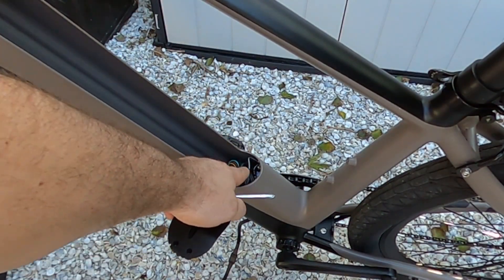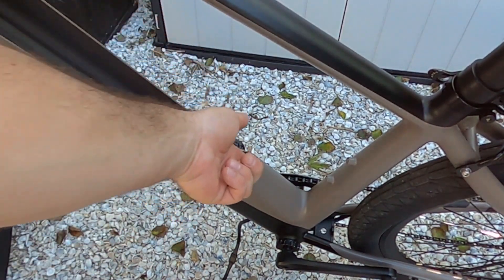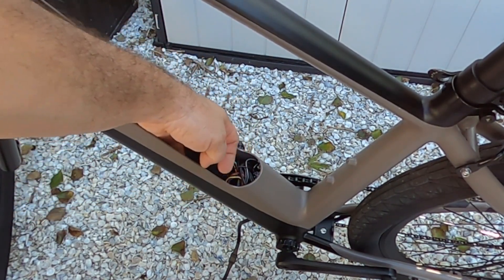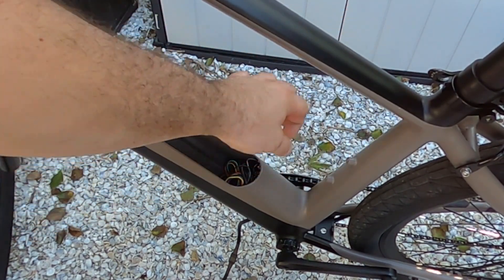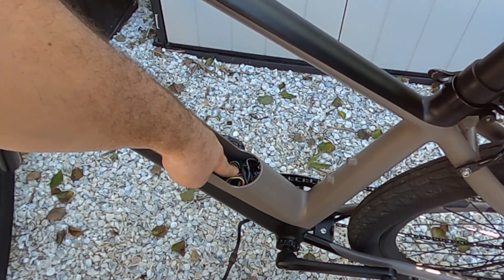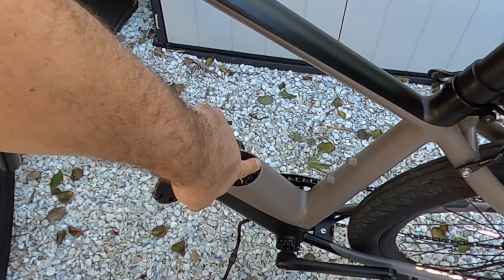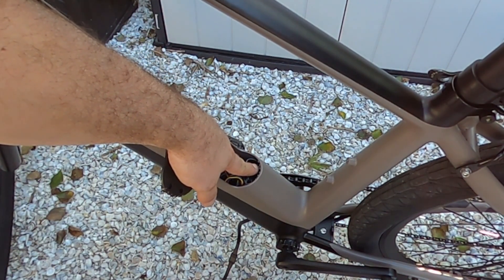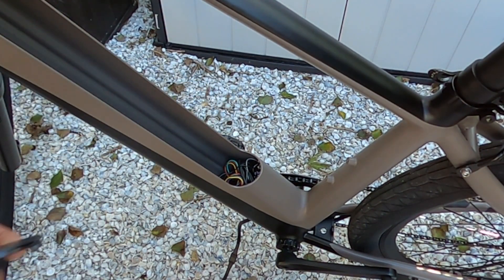All right, so we got the wire in there — it is a tight fit, so you're going to have to take some time. Main wires go down the body here, so it's controller first, balancer on the opposite side of the controller, and then longer adapters go down the main housing over the top. Smaller gauge wires get bundled at the top, and then your plate. Make sure that your smaller gauge wires do not get trapped in your threads for your screws — they will ruin those edges and you will short out your controller, so be careful.